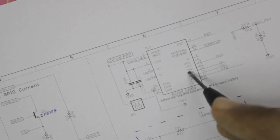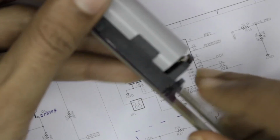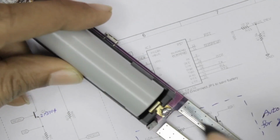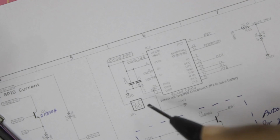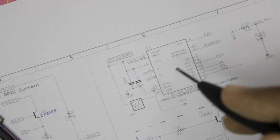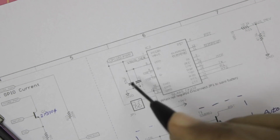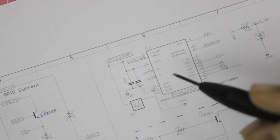So how it works is that another important thing here is the jumper pin, which you can see over here on the board. We have added a jumper pin so that when you don't want this USB to UART section to work, there's no point wasting power in powering this IC. So you can just remove this jumper pin and this whole IC will be disabled and will no longer be powered.